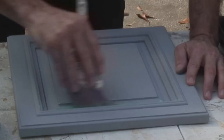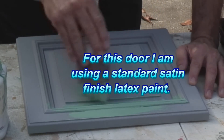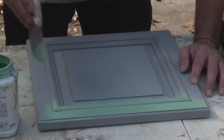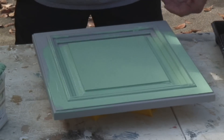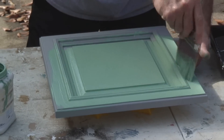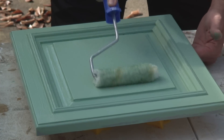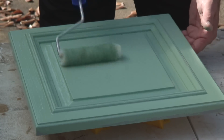I'll take it right in the cracks and cover everything real well. You may have to put two coats on here, and that's fine — I like to put two coats of paint on anything that I'm painting. I'll hold it up to where I can get paint all the way around. Take your roller and press it down in there — you want to knock all these little brush strokes out, so you want to press it.